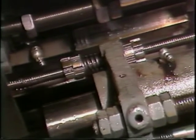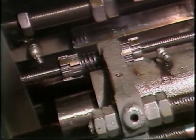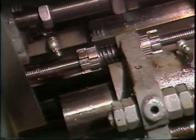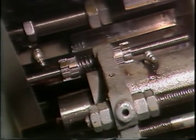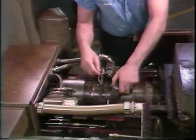The spring of the push bar cushions the action of a cam on the auxiliary cam drum. The spring should compress slightly as the tap first touches the workpiece — the pressure causes the tap to start cutting. The spring should have little or no pressure on it once the tap begins to go into the piece.